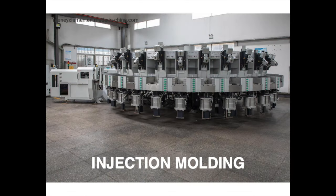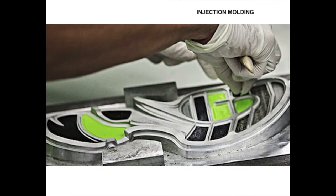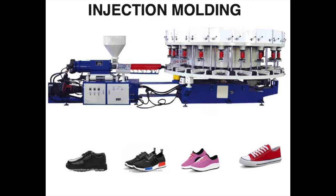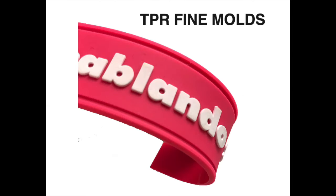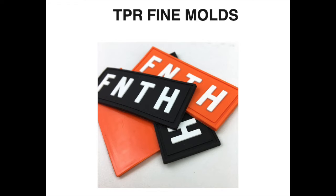These are some injection molding machines in footwear factories. You also need to understand fine molds or TPR molds. These are rubber molds that actually hold a great amount of detail — a lot more detail than you can get with color lines on an outsole. Fine molds can take a great amount of detail, and rubber fine molds are traditionally used for patches of different types. You can use them in different places on shoes. TPR is thermal plastic rubber, if I'm not mistaken.